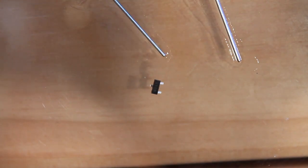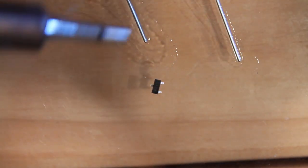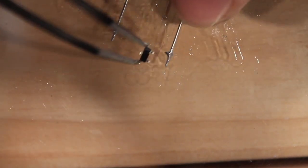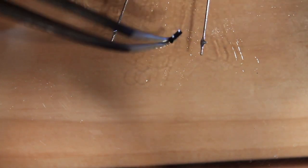Next, clean your soldering tip off — I'm just wiping it on the sponge — so you've got a nice clean soldering iron tip. I'm using some 0.8mm 60/40 tin-lead solder, and you just want to get a little bit on there. Now, you're going to want to flip the SOT-23 package upside down so you're seeing the underside of it. That way the little gull wings can rest right on top of the wire. I've still got a lot of flux laid down here — it's all nice and wet.